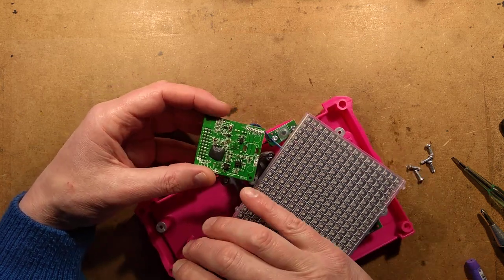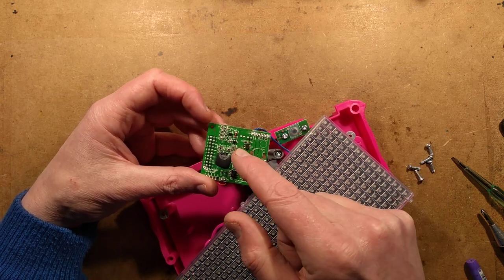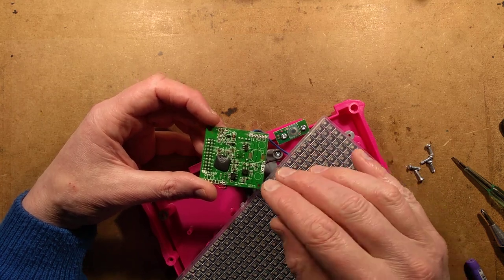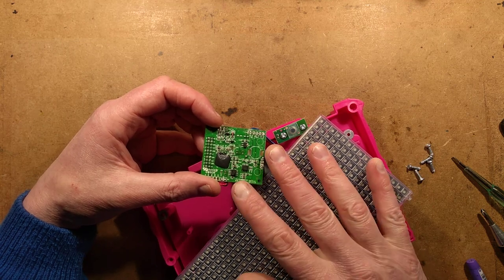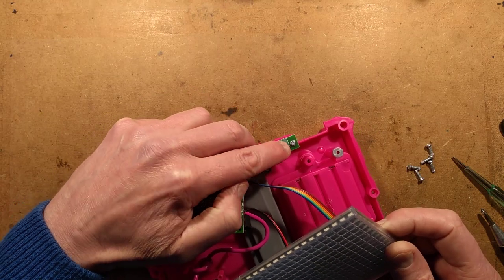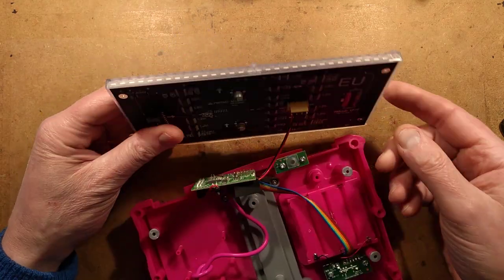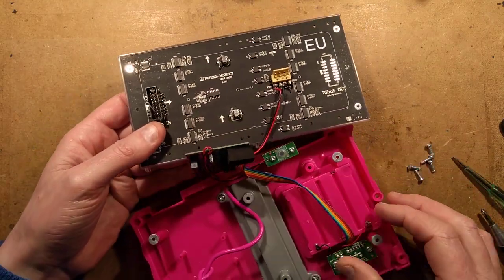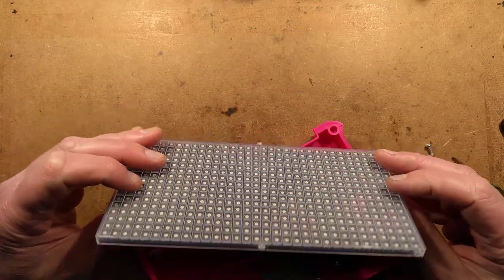The other area with a bit of extra circuitry is the connection to the headphone cable. It turns out it's got three connections: the microphone, ground, and the right audio. I'm guessing the right audio is data coming into this unit and the microphone has been used for sending data back or control signals. Excellent. There's also a little off-board button, and that pretty much sums that circuit up. But then we get on to the spicy bit — this other board is just purely a switch for setting modes.